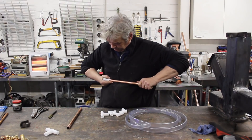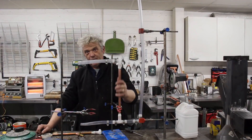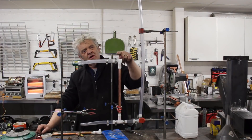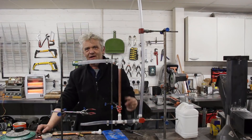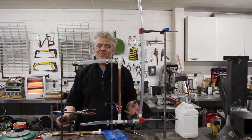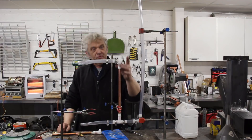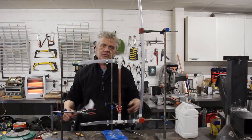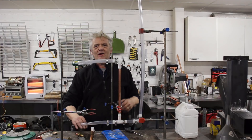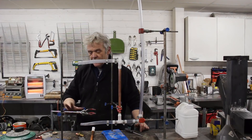We're halfway through putting it together — you can see how super simple it is. There's one of the copper pipes that'll be the cold pipe. I've put hose clips on all the joints and cut my pipes to length with these little angles in. That's a lot of work because I want it to look pretty, but you don't need to do this. You just put the pipe straight on the hot and the cold, bend it over, tighten up with the hose clips and you're away.